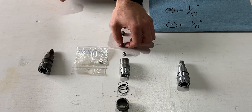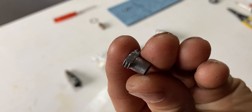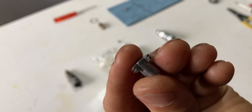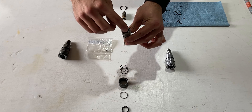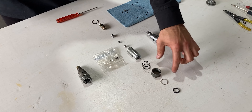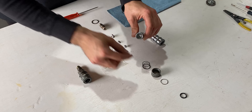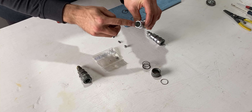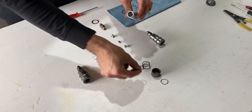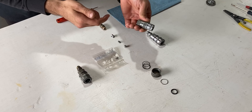The next thing that backs this ball bearing is a small spring. The spring is centered and held in place by this end cap, which is threaded on all three points and fits into the back of this hydraulic coupler body. From the hydraulic coupler forward we have four more components — three are external and the o-ring is internal. The o-ring will be mounted within the hydraulic coupler body and allows a perfect seal when the male fitting is inserted.